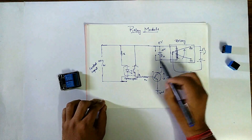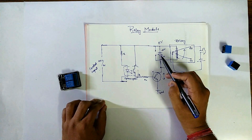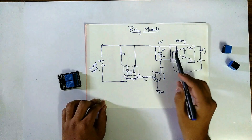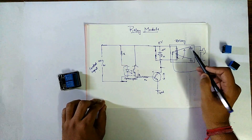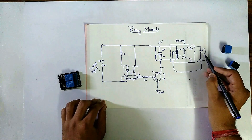In this case, the diode will be forward biased. If the diode is forward biased, this path will be closed, and the electromagnet will now become de-energized. Once it is de-energized, the arm will be pulled back to its initial position, the path will be open, and the bulb goes off.